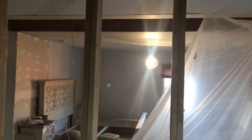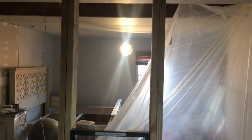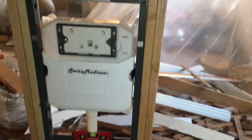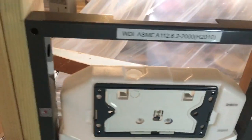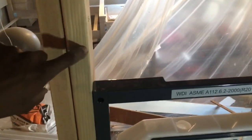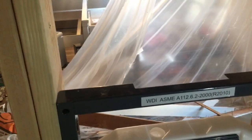So essentially, to start out, what I've been doing is getting my framing put together. I think it's 19 inches and 13/16, something like that, or it might be 11/16, one of those. To support this part, you're going to need two studs here to carry the weight, and I got these basically fastened together as well as attached up top and at the bottom.